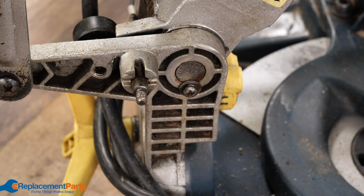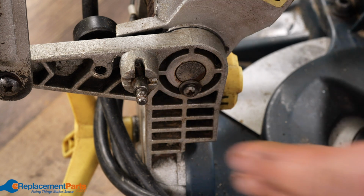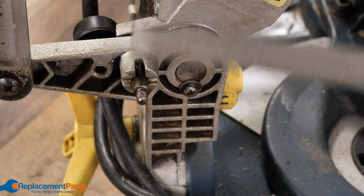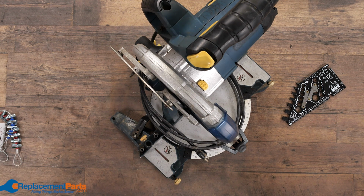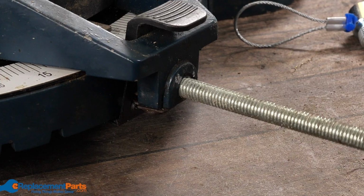So we can go out and have a look for a knob with M6-1, or we can look at just getting a bolt on here. We can round it, spin it on a drill, put a file against it, make it round, put it on with a bit of thread locker, and make our own. Other option, especially for handles, is quite often I can get myself a piece of threaded rod, the right diameter, and I can make the handle.